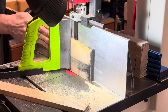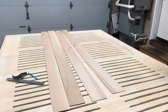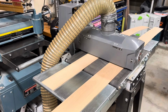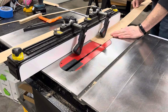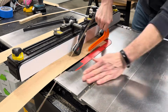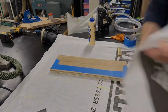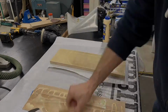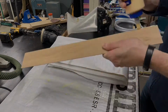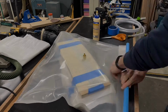I did not have enough white oak left to make solid drawer faces for all 6 drawers, so I cut thin veneers out of the piece I still had. A lot of this went to veneer that piece of the footboard that I showed earlier, but the rest was used for the drawer faces. I ended up with veneers slightly less than 1/8 of an inch thick, and I cut them all to size. Some of them had to be taped together, and I made a big stack and put it in the vacuum press. PVA glue like Titebond really isn't the ideal thing to use for veneers like this, but I really didn't feel like mixing up any catalyzed glue.